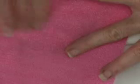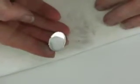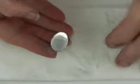Now it's time to move on to the next paper. And I just repeat the same thing for each grit of paper. The order that you want to do this in is green, gray, blue, pink, mint, and then the very pale green. So now I'm getting pretty shiny here. It's not quite shiny enough. I still have a couple of grits to go.